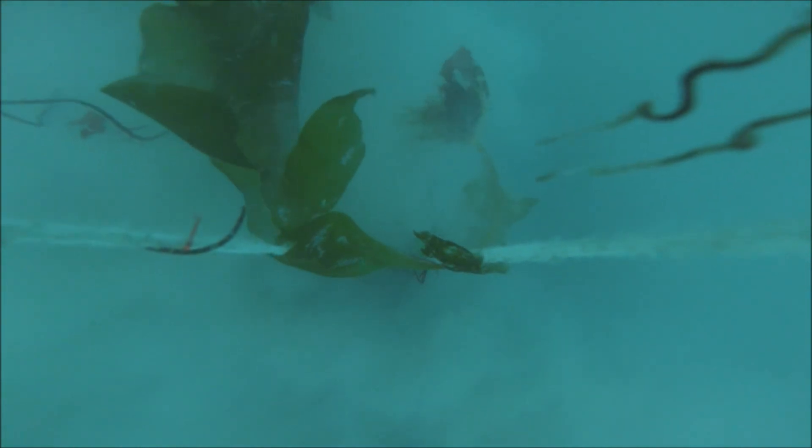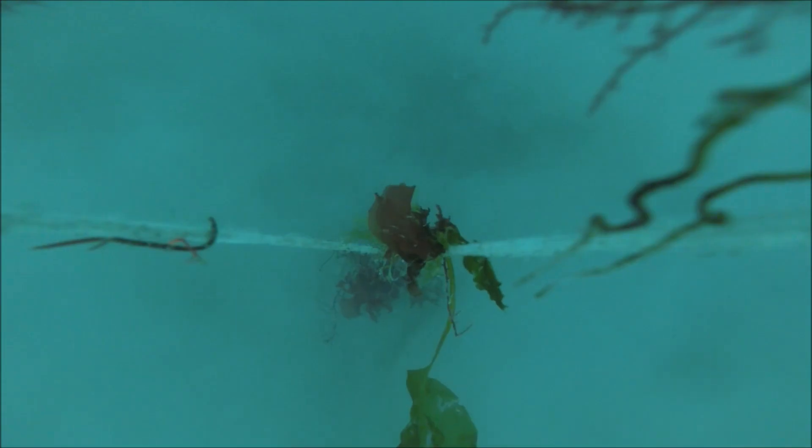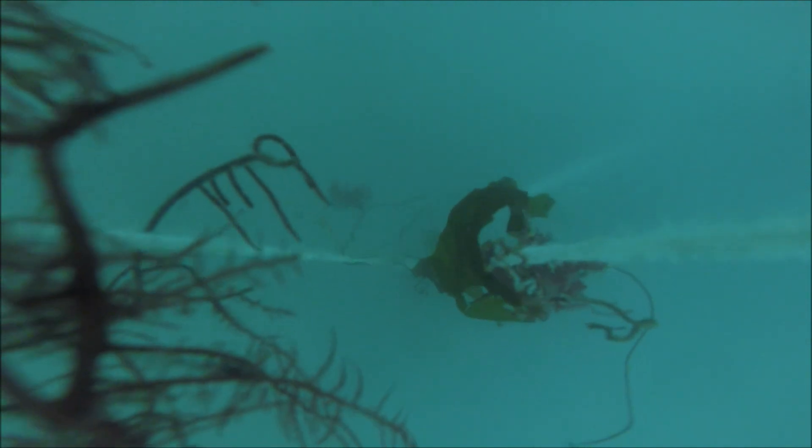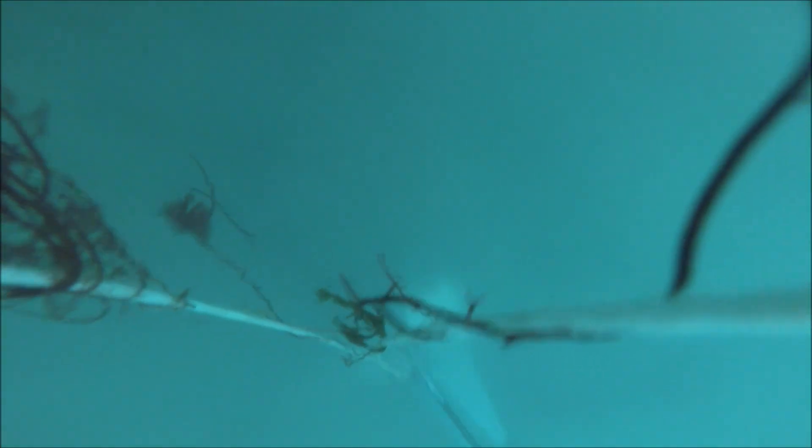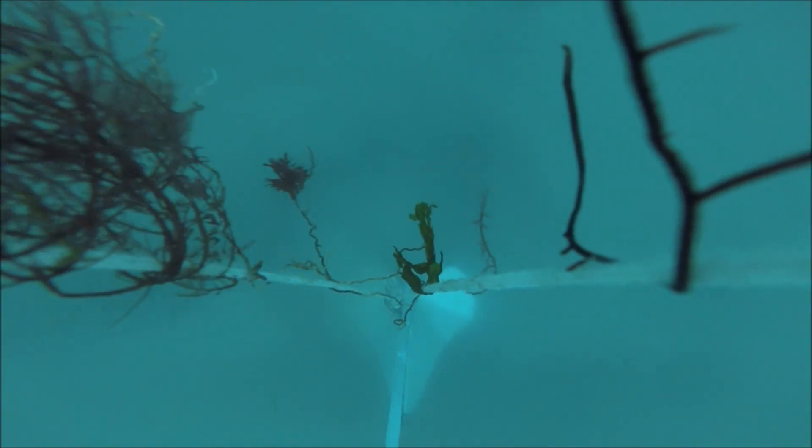The eighth reset was a partial backflip. Here's the ninth reset — can't tell just what happens there, but a short drag stops the boat. And the tenth and final reset — just getting too much turbidity, can't really see; maybe there was a backflip. A bit of a drag, and stops the boat. On retrieval, it took quite a bit of effort to break out, and we'll see that the fluke is just about spotless — there's just a little bit of mud at the tip.